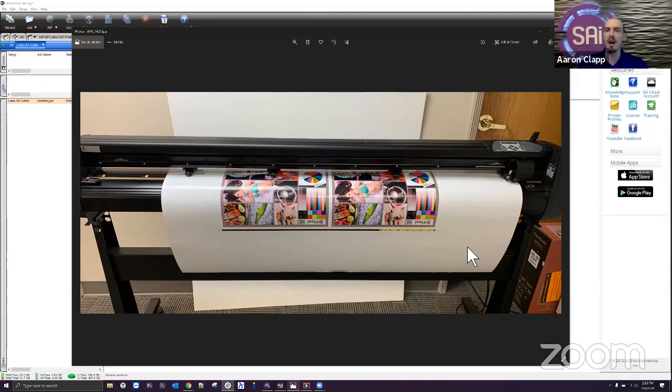So continuing on here, what I wanted to look at is just making sure you have enough space. That's all I'm really pointing at here. You've got to have enough space in between these pinch rollers and here. Now, like I said, this is excessive. I'm going overboard with my example here, but that can cause issues with reading these barcodes. So just be aware of that. Make sure that you give yourself an ample amount of space, not trying to hug the material like half an inch on the edge. That's just not going to work. So give yourself some space.